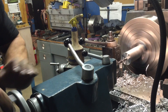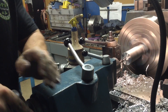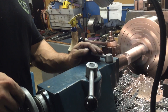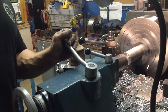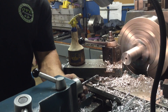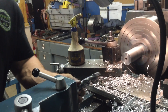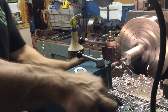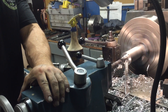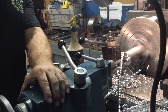So here we've got the pilot drill going in. This one takes a little while, so you won't see all of that. And here we go, we're going to pop out the last drill. Just finishing up the center drill operation, pop that out, swap that out for the next drill size — this will be popping it out almost all the way to full size but not quite. We're going to drop a one-inch drill in here, or something bigger than that. Nice streamers on that high-quality material there, and that'll run out pretty quick.